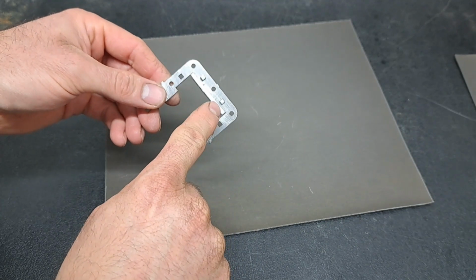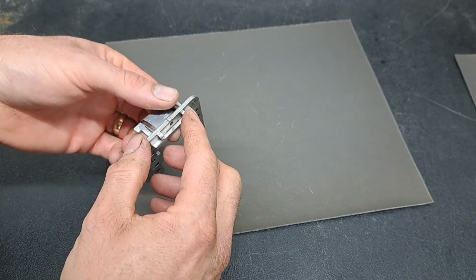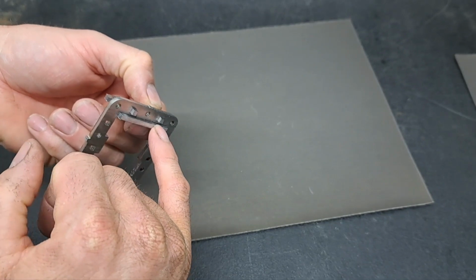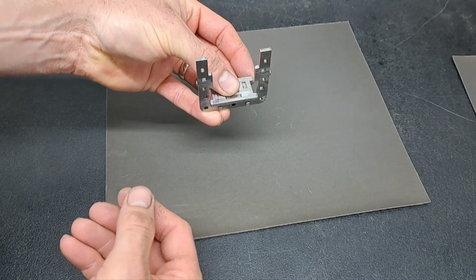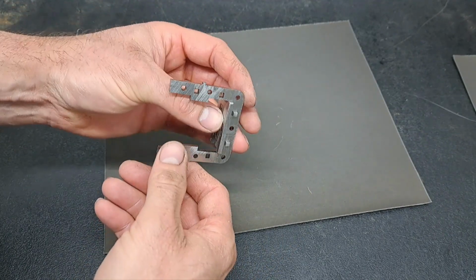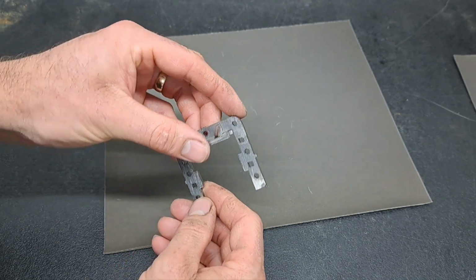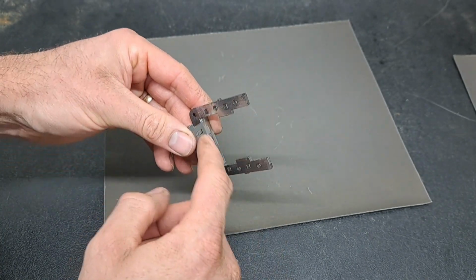The three pieces work together and hold it. And there you go. The backs of those are just sticking through there. We'll file those off after we've soldered it. You start to see that lip there is what's going to fit against the top of the openings in the frame and locate the horns in the frames. So now that we've done those, these will get filled with silver solder in the process of fabricating it. And even if they're not, it won't actually hurt. That's not a working face.